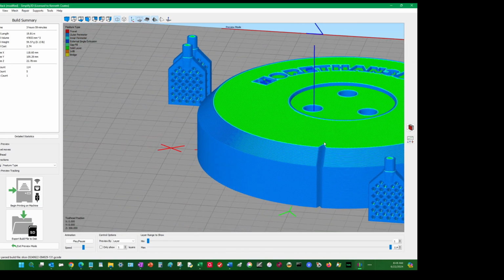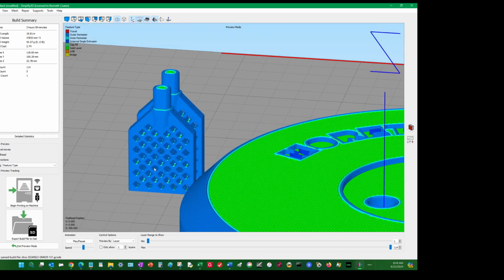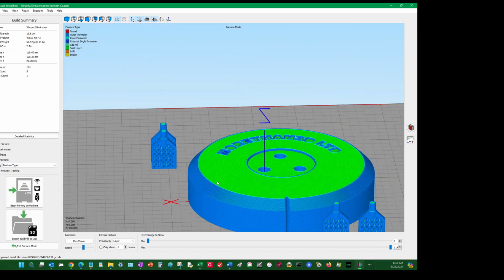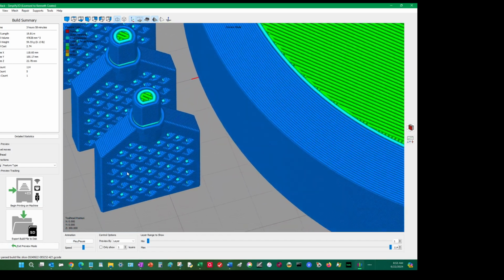Yeah, so we're going to try it this way. If for some reason these axles break off, then we'll figure out something else to do. I may have to make up my own axles where this pin is a separate piece that prints horizontally, and these are printed vertically, and then you plug it in. That would be a better design based on some other stuff I've done. But again, if it's a problem, I could redesign that.